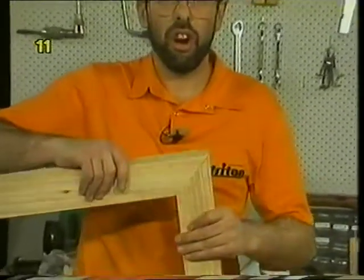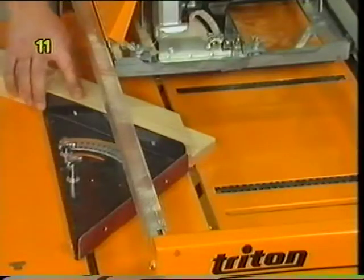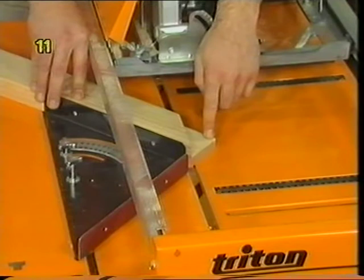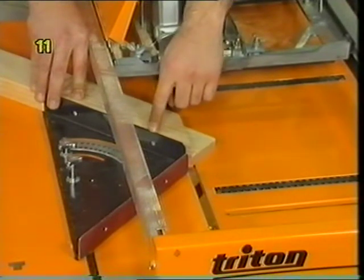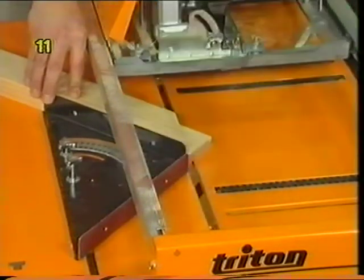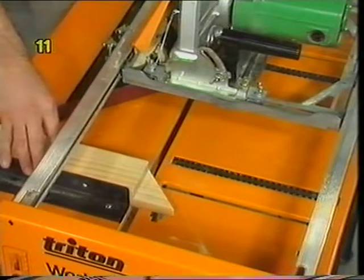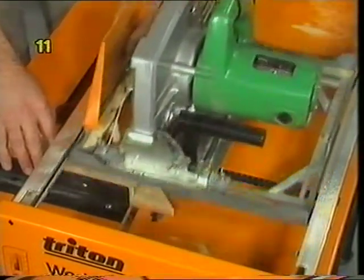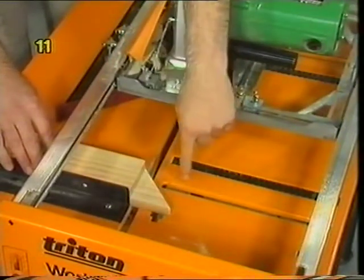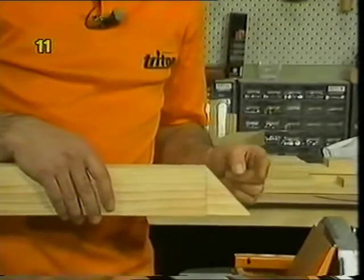The half lap mitre joint is an extremely attractive joint because it's mitered from the front and yet it's also very strong because the two pieces are halved together. The two halves of each joint are not the same — don't fall into the trap of making them all the same. Take one piece of each joint, raise the saw blade to cut halfway through the work, and with the piece resting against face A of the mitre gauge at exactly 45 degrees, make a series of cuts removing the small triangular waste. Then take the other piece, place it square to the blade, make a series of half-cuts removing half the wood to the end, then lower the blade to full depth and remove the small triangle of half material still connecting.